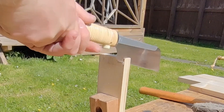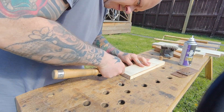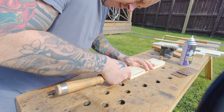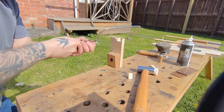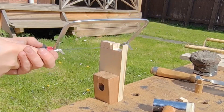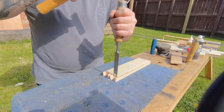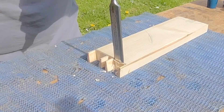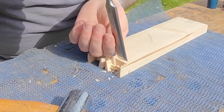I will recommend that you use a good dovetailing saw. Another thing I like to do is remove the shoulder lines — I use my coping saw to remove the material, trying to get as close to the line as possible, as this is going to be beneficial for when you're chiseling out. Then I remove the excess material down to the shoulder line with my chisel.